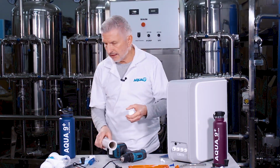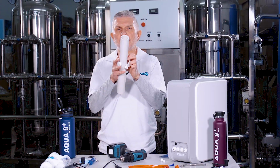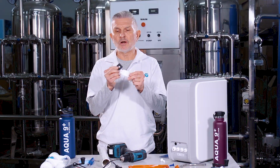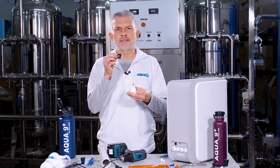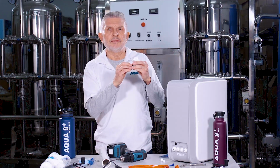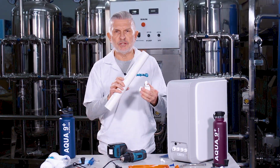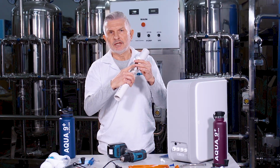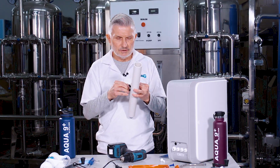Now before mounting the drain clamp to the drain pipe, you take the gasket that's a part of the drain adapter assembly hardware. One side has an adhesive, and what you want to do is mount that inside the drain clamp like so. Then mount that drain clamp over the drain pipe, making sure that you align the hole that was drilled with the hole of the drain clamp. And then secure it with the bolts and nuts that it comes with.